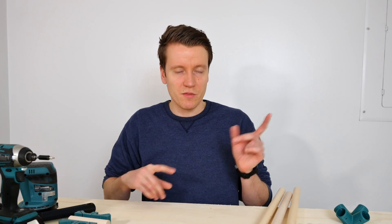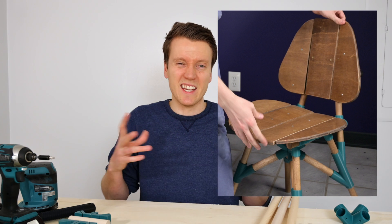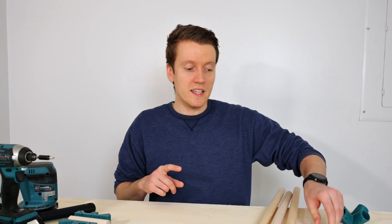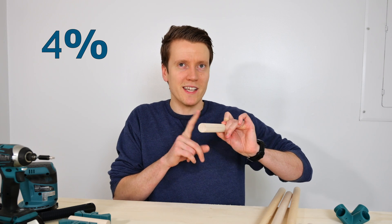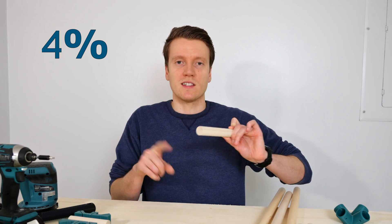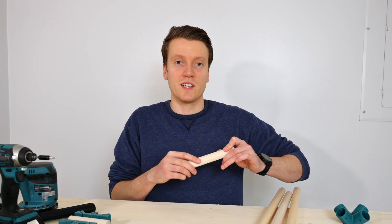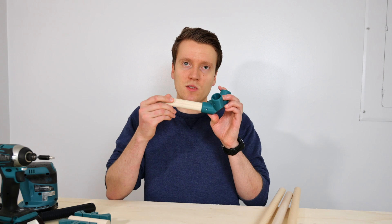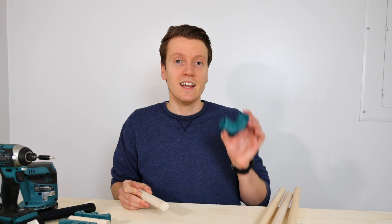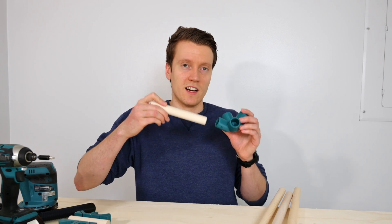My chair will be slightly different from his. Since it is inches instead of millimeters, it will be 4% larger. So any measurements from his designs, I scaled up by 4% — it's 104% of his chair — to get the dowels to fit. A great way to test that is to print out some pieces and test some dowels to make sure they fit in there snugly. You want it tight, but easy enough to fit.